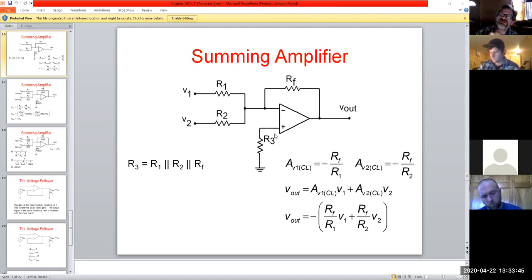So when we do this simulator model, remember this thing's going to be ideal. Actually, that's a great thing, really, so you'd be able to treat it as such. And the only thing that we'll be going into when we do these labs for the op amps is setting what our voltage inputs are, so VEE and VCC, and those values are settable on the op amp device.